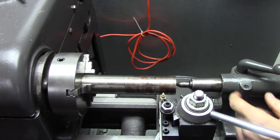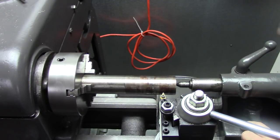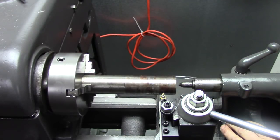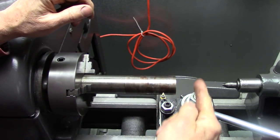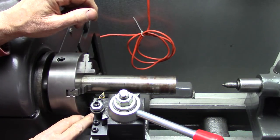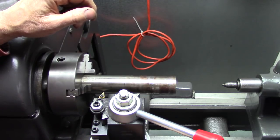I've really noticed that. If it's extending out any more than that, I get a lot of vibration when I'm trying to take off stock. I suppose if the tailstock was built with the casting kind of leaning out it would be a lot better, but this one is not, and I'd say a lot of other lathes are not. Now the old lantern style tool post had the tool always in the center, so you are automatically closer to the tailstock. Usually you would clear the chuck with your compound, because it's usually at an angle too.